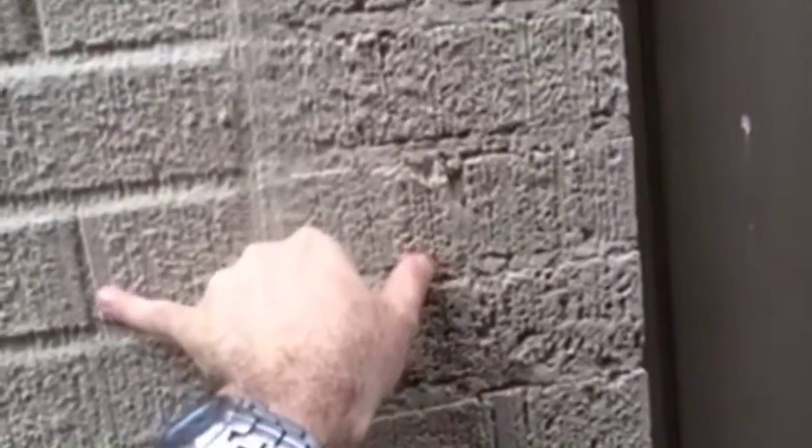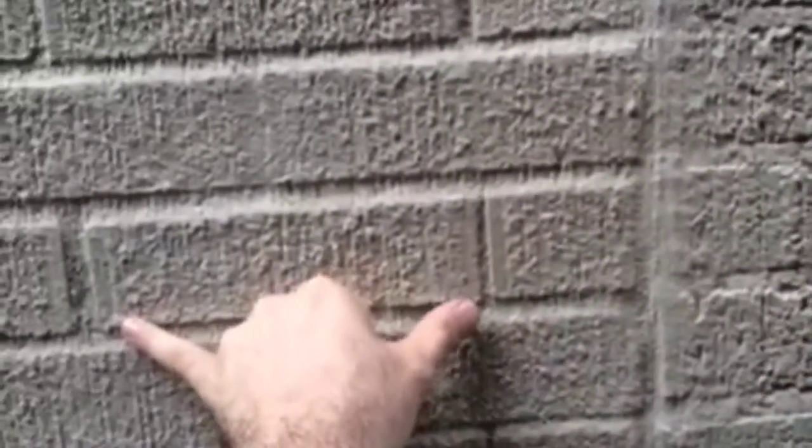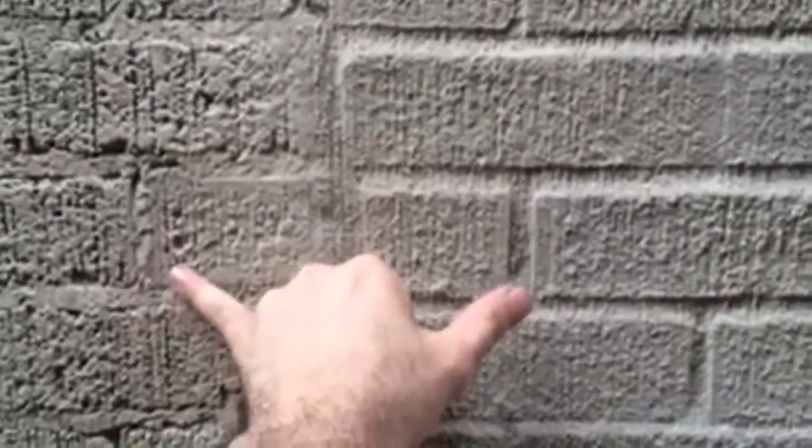And then when they install the new brick, here you'll see they'll have a full brick, a full brick, a full brick, and a full brick. But here, because they've removed the half brick, they can install one continuous full brick here, then the full brick in the middle, and then again one full brick from here to here. So you get visually a more uniform look. It looks more like what's on the rest of the wall, where you have brick, brick, brick, brick, as opposed to seeing all these little pieces of half brick and a very clear indication line of where the opening once was.